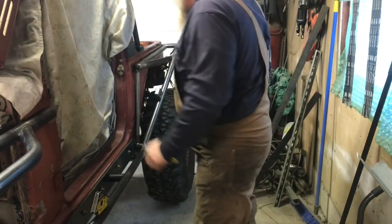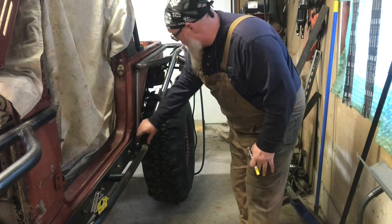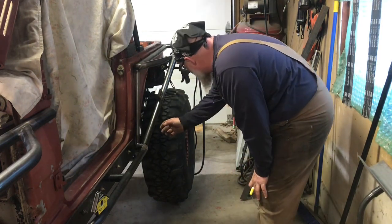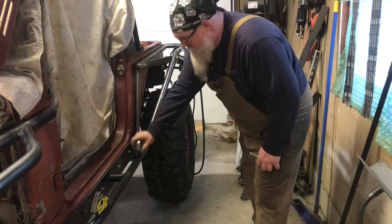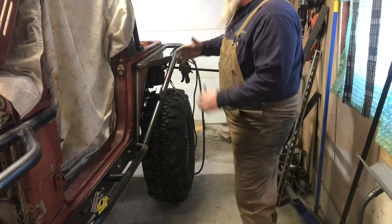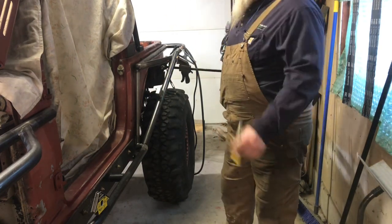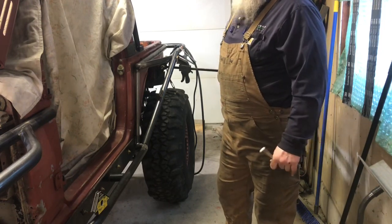Alright guys, I've got this marked up in here. I need to clean up this bottom edge just a little bit, bring that down in. Clamps throwing me off just a hair, but I'm using a little angle block, setting it to 0 on the rub rail because that's the line we're working off of, and then put it up here. Well, we're probably within the accuracy of the little block. We're within a 1/4 degree of each other.